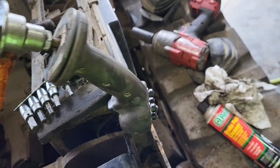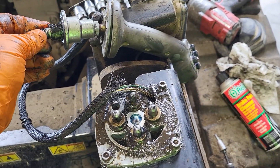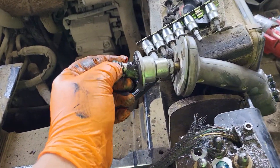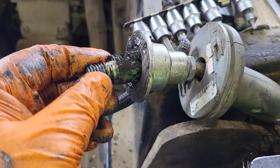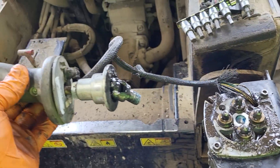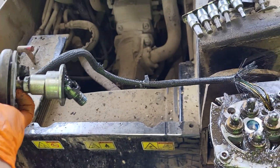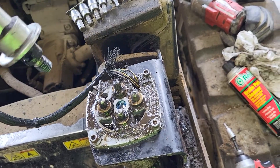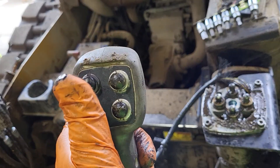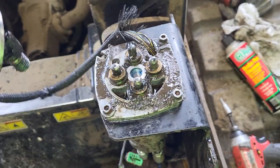That's what you want — have that come off. Typically if you're going to be resealing those, if your handle is wobbly, moving around and loose, this is what goes bad — that universal joint. You can buy these from Wheeler or from Caterpillar, any of your Cat dealers. That universal joint just comes off. This cable on this handle will run everything — it'll run your two-speed, it'll run everything — so you want to be careful with that.